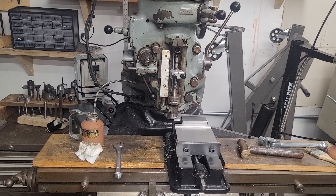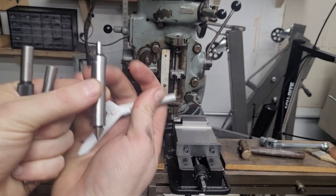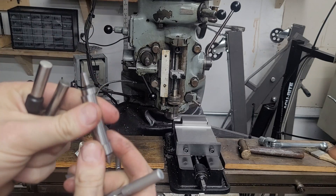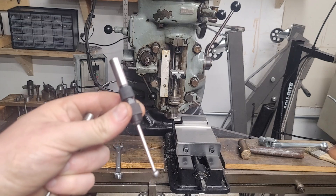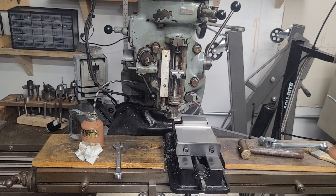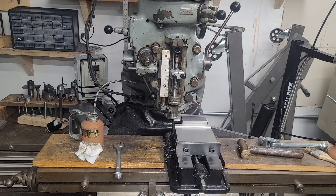This is a pretty conventional style of eccentric edge finder — I think this is one of the more popular ones right now. Half inch. They're good, they work well, I like them, they're accurate. This one is the Starrett number 828 Wiggler. You can get a ball on it or a point on it — these use a 3/8 shank. So this one's a really good center finder. These are edge and center finders.